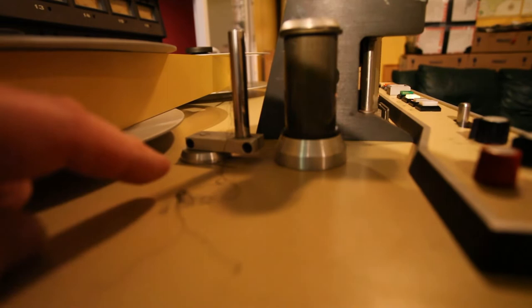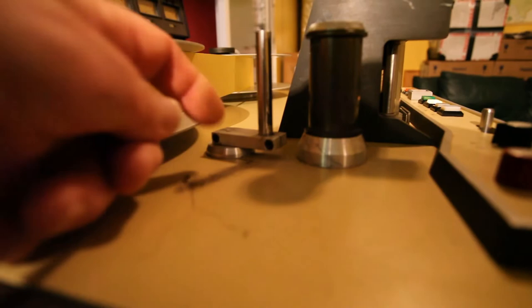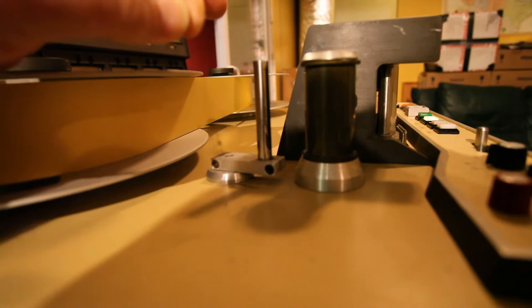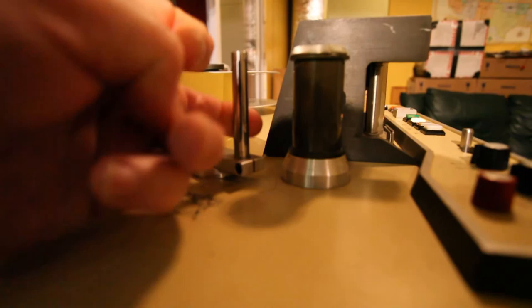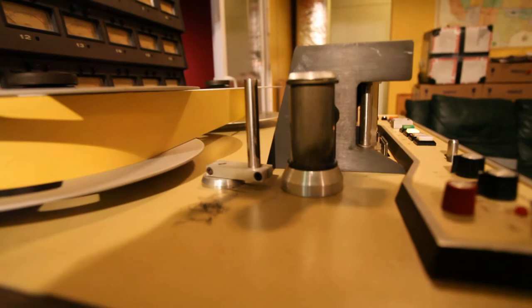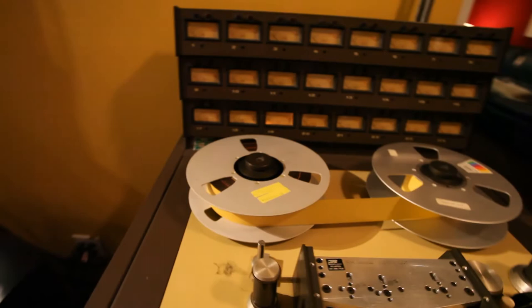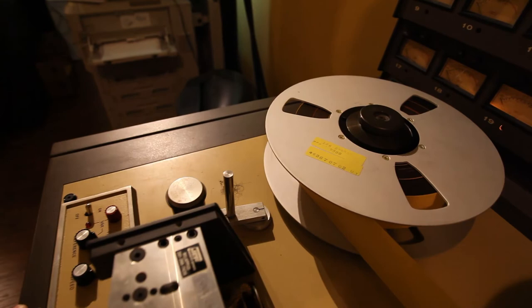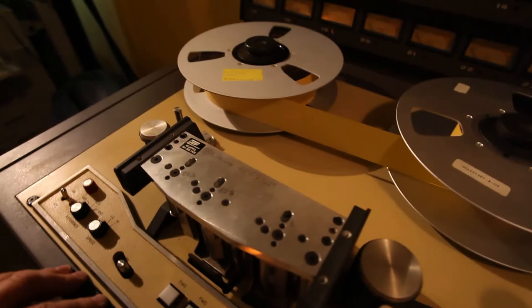This is the guide that takes on the first piece of metal that the tape hits as it comes off the spool. You can see here, as I'm holding this up, these are all particles of the tape. The guide — as I'm rubbing my finger — needs to be cleaned with alcohol because it's pretty sticky. So that's where we're up to. Everything has been going absolutely amazingly well — we got 10 tracks off so far from the other three reels and everything's worked out great. We'll continue; I'm not saying this is not going to be possible to get back, but we'll have a bit more work to do.